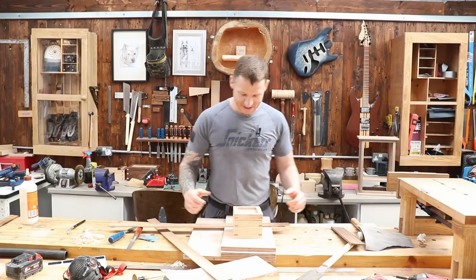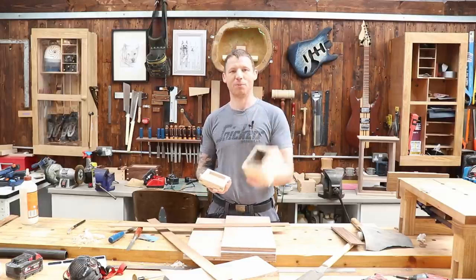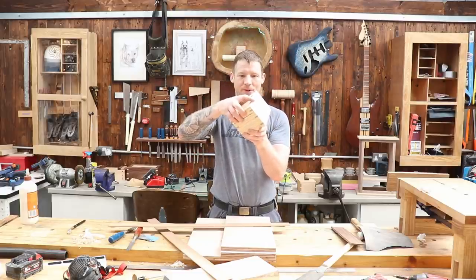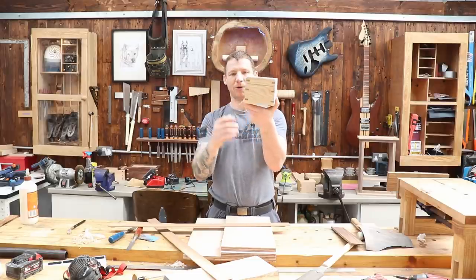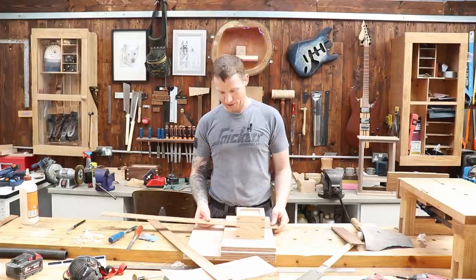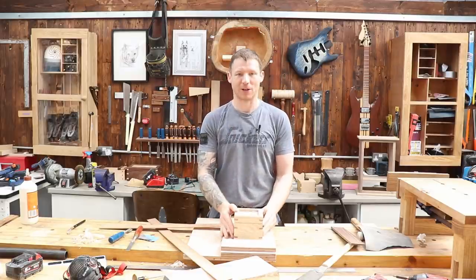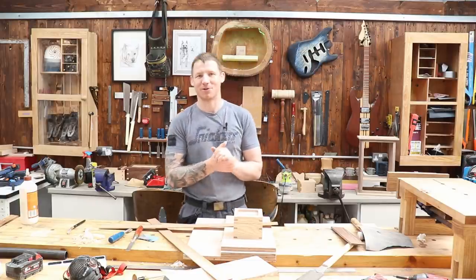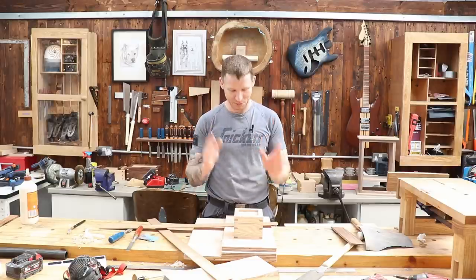It's the next day — let that be a lesson: don't work late at night when you're tired or you do stupid stuff like try to cut boxes on a mitre saw. We've squared everything up and the lid is fitting nicely, but we're left with a two mil gap all the way around — my lid is hitting my internal box. If we're going to have something we're going to look at, we're going to make it a feature. I have some cherry veneer here, so I'm going to fit that in that gap all the way around. We'll have a nice cherry line as a decorative edge — making it a feature instead of a flaw. All the puzzle cubes are together forming a perfect cube.